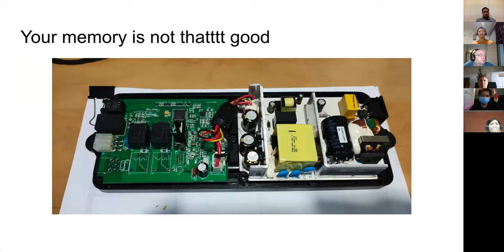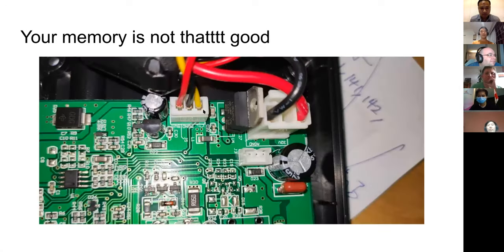When it comes to hardware hacking, we always think we can remember the color sequence of the cables — green, red, black — but after two hours of hacking, you forget which cable goes where. So it's always good to take a photo, make sure everything is documented. You can see clearly in the photo which pin has which cable, so when you put it back you don't end up reversing connections and shorting your hardware.